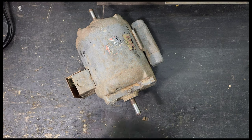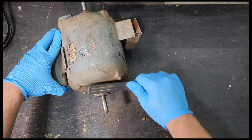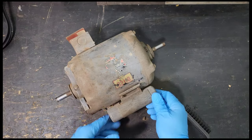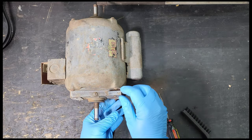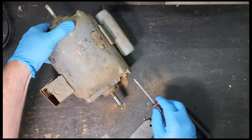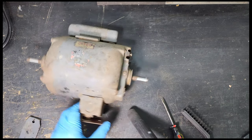This is the motor that we're going to be adding to the saw. It is a Delta motor and from what I can tell based off the stickers, it's probably from the mid 40s to maybe early 50s. There's no way to really date this as there's no serial number on these motors. This motor looks kind of rough, but realistically all it needs is a paint job because the motor spins freely. You can see there are two screws right above the shaft on either end where you can add grease. If they're stiff, you can take them apart, clean out the old grease — which will probably be the consistency of candle wax — add new grease, and they will run just fine.